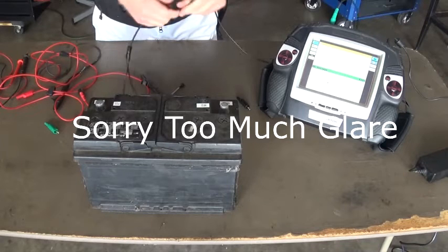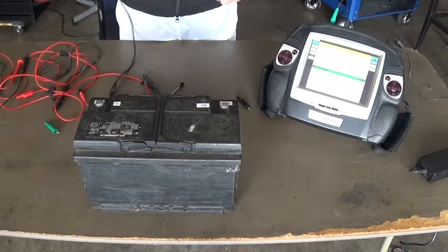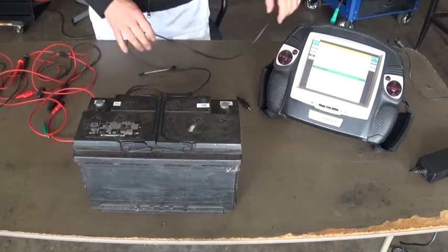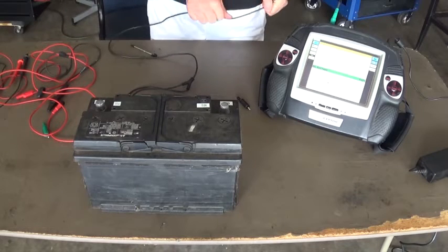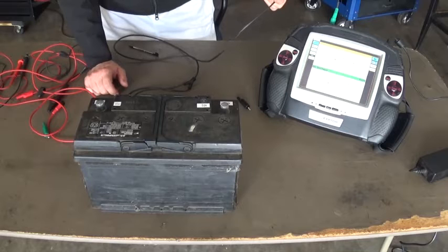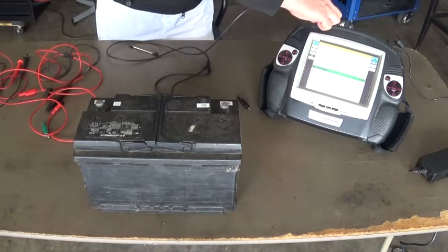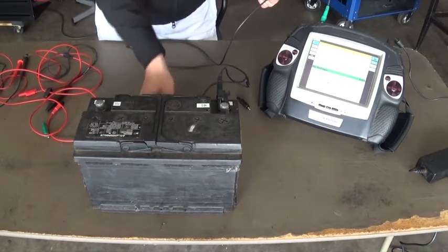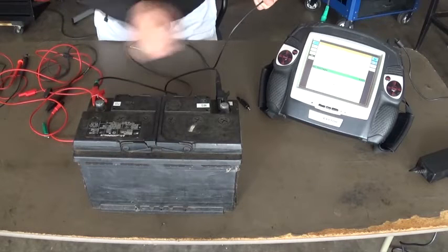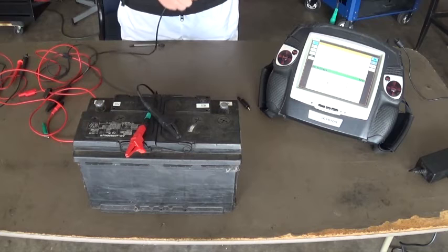Somewhere they are shorted. I cannot duplicate the problem anymore but we could see that they were definitely shorted right in here. If I pinch this part of the cable, my leads are shorted. Let's see what happens when we connect those to the voltmeter with measurements — you can see the arcs right there. I think I proved my point that we have an issue on this test lead for sure.